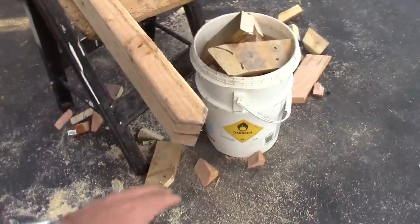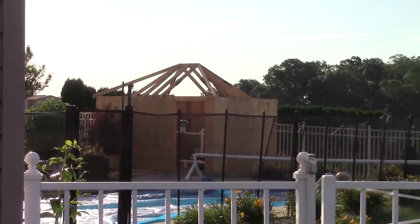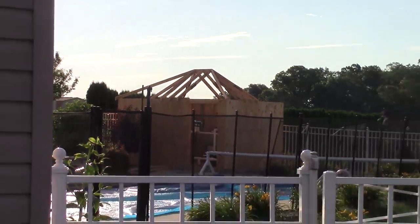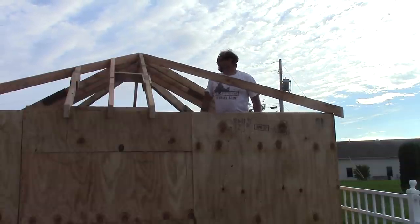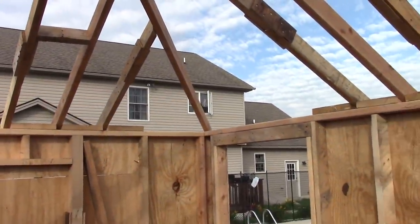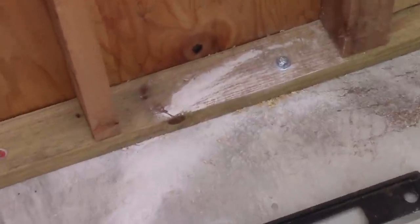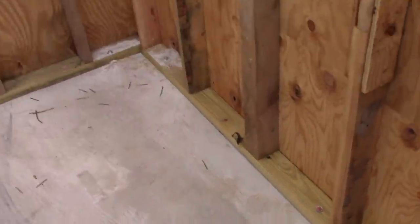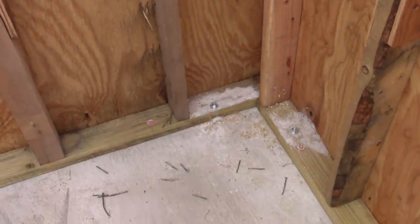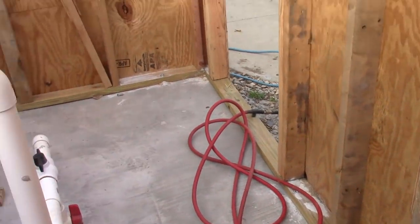Here's a look at the rafter tail at 45 degrees with the bird's mouth, and the front has a nice cheek cut as well. This is the little pool shed that I'm building — it has the hip roof, and I have several videos on this build. Things are coming together really well. I just have to nail in that last hip rafter. I went through and got some anchor sleeves, four-inch anchor bolts about half-inch, drilled them out with my hammer drill, and set all the corners because my concrete guy had the J-bolts in the wrong spot. That's all fixed, the walls are super solid, and things are going well.